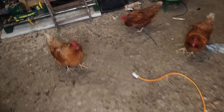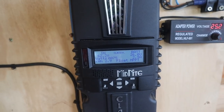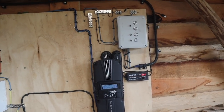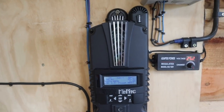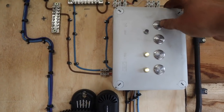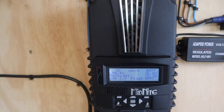Hey, you lot aren't supposed to be in here - out, out, out! Okay, it's done its sweep so we've got the one nozzle on and the manual one is off. 75 to 78 watts - big increase there! So let's tune the other small one up and then we'll do a full power test. We've just got the one manual nozzle on now and with that tuned we're at around 40 watts - we've doubled that one too. Let's do a full power test - turn everything up full whack.